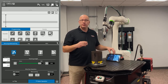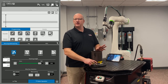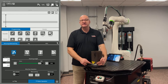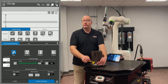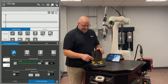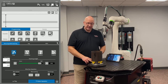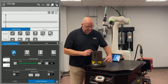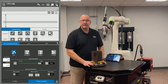You need two circular moves to get around a full circle — each one is a half-circle arc, called a Weld Point C. With a circular move, it takes the previous point as the starting reference, then you go 90 degrees and put in a Weld Point C — it inserts two points but only records the first. Then you go another 90 degrees — now 180 from the start — and touch up the second point of that Weld Point C. Then another 90 degrees for 270 total, add another Weld Point C, and at 360 degrees touch up the second point of that second Weld Point C.